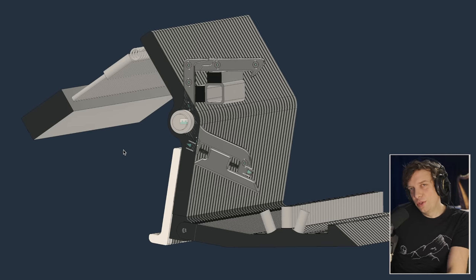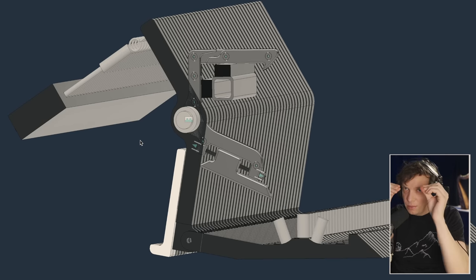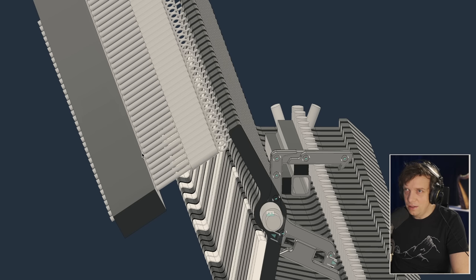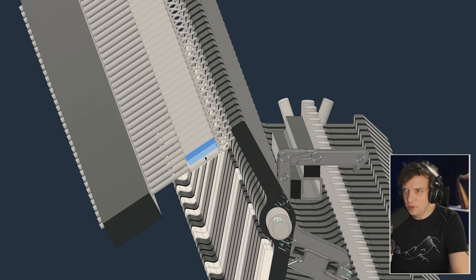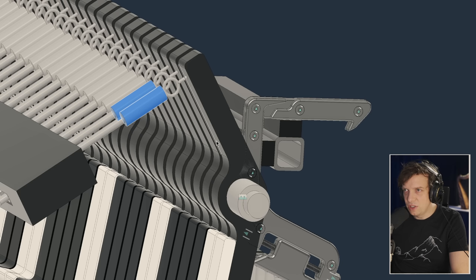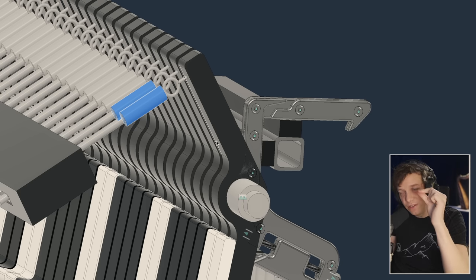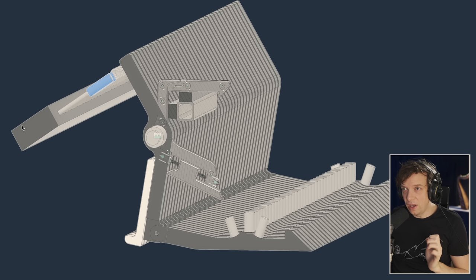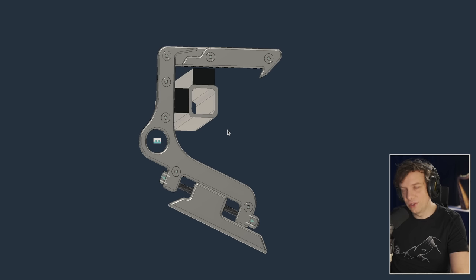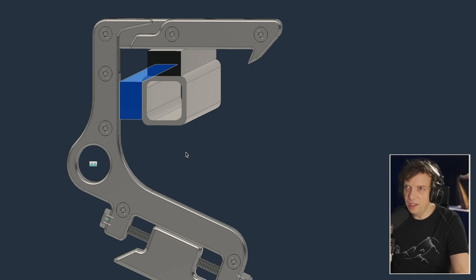The new design is reducing noise in many ways. First of all, it moves less. Smaller movement, less energy to make sound. And then the old design had these spring systems where the thing was spring-loaded. When the programming pin let go of one of these channels, it kind of fell back and banged itself into a thin felt. So on the new design, the resting position is not crucial for the timing of the music. I can have this foam pad being really thick and cushy.